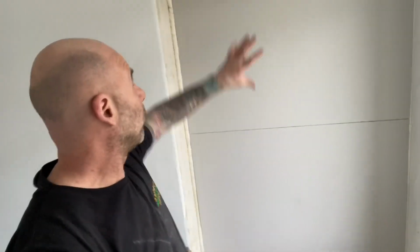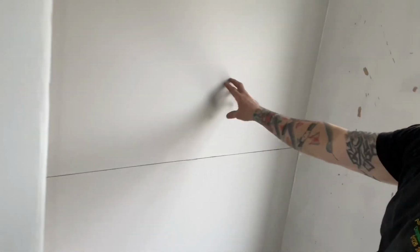You can get longer screws for plug sockets. That'll be sliced off, scrimmed up, and then skimmed. Warm the wall for her. That is going to have Sure-Therm on it, so it'll be painted with Sure-Therm. It's that anti-condensation paint. It's the worst area here, so condensation will form on there, and I think it will go onto here as well.